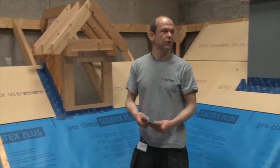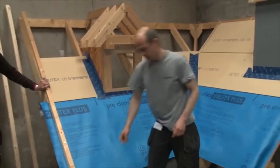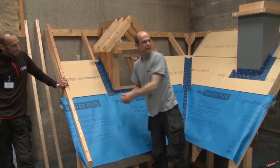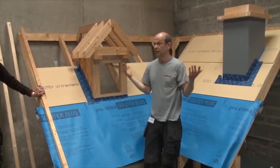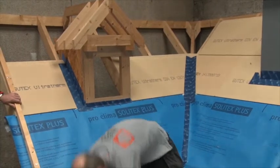The worst I see now and then is drilling through the slate, through everything, putting in a bolt with a bit of silicone on top — and it does leak. Those are the first complaints you get, so it is a real issue. Those are the grommets for cables.